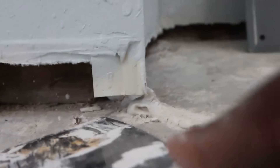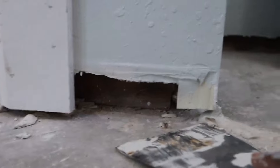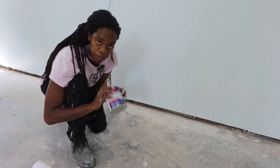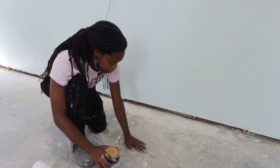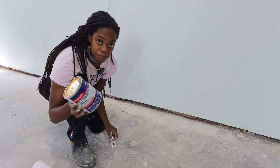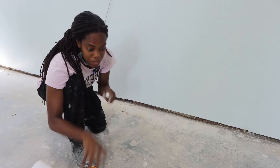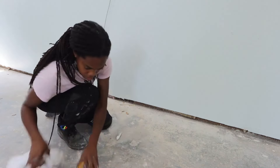If you have nails sticking up or putty built up, pull those nails with a crowbar or hammer and scrape up the putty so you have a flat surface. For the gouges in the concrete, I'm applying all-purpose putty. If someone steps on the flooring over an unfilled gouge, the flooring will flex and they'll feel it. The putty came with a hardener — I'll mix and apply it, clean out the dust first, then let it dry.